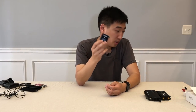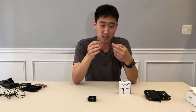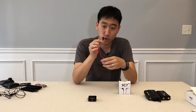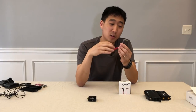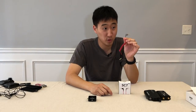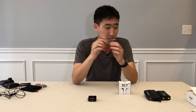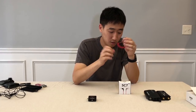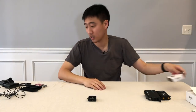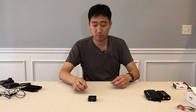If you're going to use this on your phone, you do need to pick up an SC7 cable. That's a cable with two 3.5mm jacks — one side is TRS and one side is TRRS, meaning tip-ring-ring-sleeve. So if you're plugging into your phone you need this, but if you're not recording on your phone you don't. It already comes with an SC2 cable and most of you will be good with that.